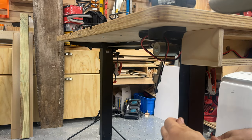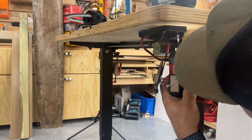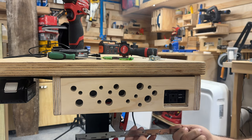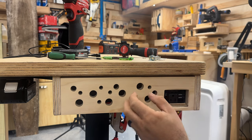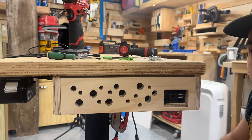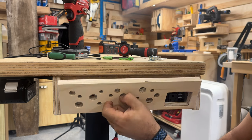It's so gratifying once you get the first screw in and you don't have to hold something anymore. So time to finish this up. I'm going to be putting a piano hinge down at the bottom to make it come out like this. The cool thing is it's very snug right now — this is in here without being attached to anything. I did not want to have to put a knob or something on this in order to open it up, so in making my fun vent holes, I can just pinch right here and it will hinge down.